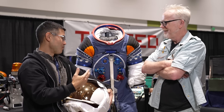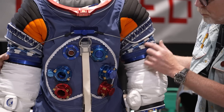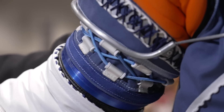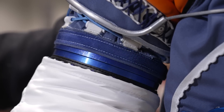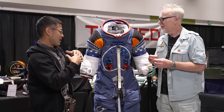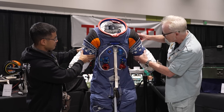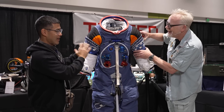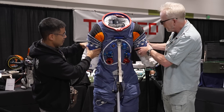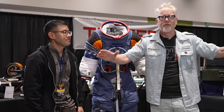I'm trying to make everything to spec without guessing, so I've had to acquire a lot of original parts, going to ILC Dover and measuring things. These little bushings here with the parachute cord going through them — the real ones were Teflon, I just 3D printed these. But the real suit had a system like this because a pressure suit has to maintain constant volume. All of these crazy little structures were just ways to allow the astronaut to move while keeping constant volume, and when you expand on one side it collapses on the other.